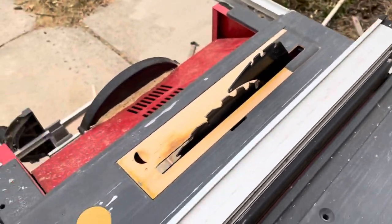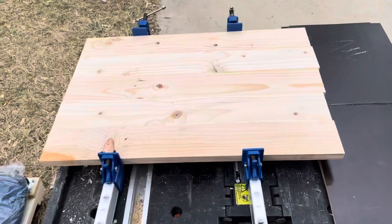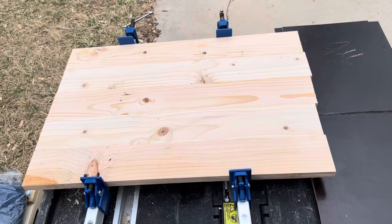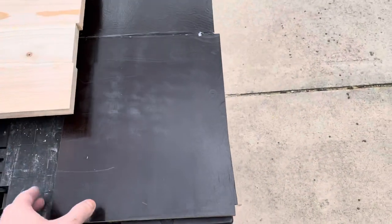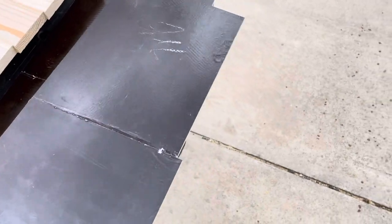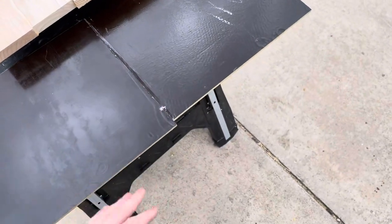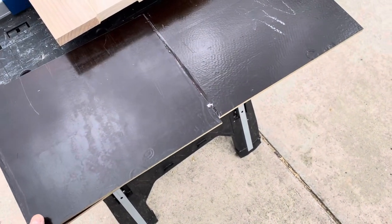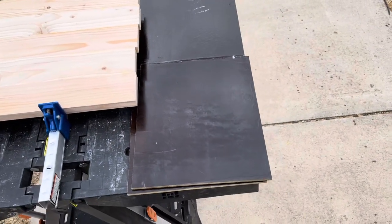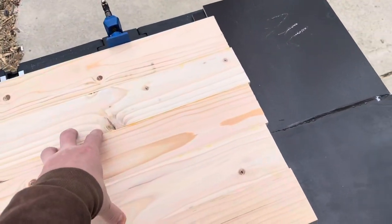New tripod gives a little bird's eye view. Last night, I glued up those boards that I milled yesterday, and I glued these into pairs. They're an eighth of an inch thick, and the glue's at the end grain, so it's about as sturdy as a rubber band in terms of holding it together, but I just need to keep it stationary until I form it into a single panel and attach it to this.